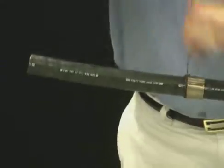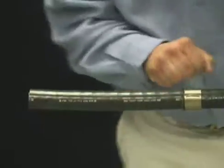Hold the twine at the ends and pull back and forth. The movement of the twine causes friction, which builds up heat, which easily cuts through the jacket. This method ensures no damage to the neutrals underneath the jacket.